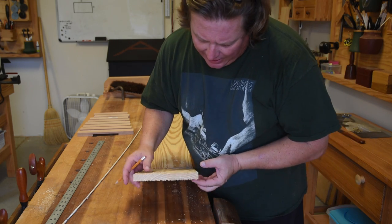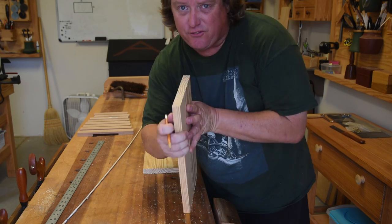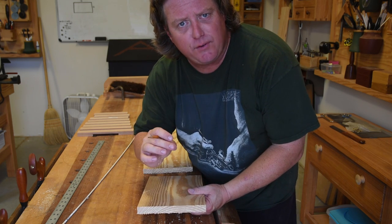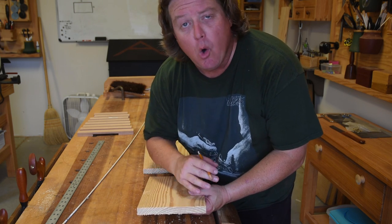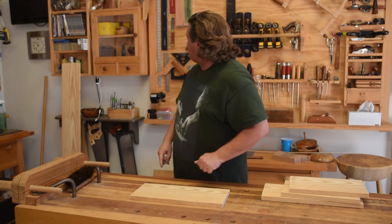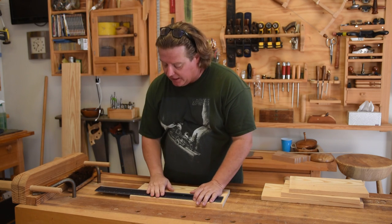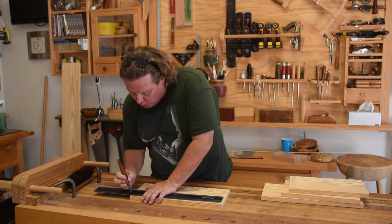But I also want you to notice how rough those panel saw cuts are. This is just butchered. It is fairly plumb and all that kind of stuff, but it is not a clean cut. So that's why I go an inch over when I'm roughing stuff out, so I can refine it at the workbench with either a different saw or a hand plane. Now, in refining our cuts, this gives us ample opportunity to practice what we did in the second section in working our sawing technique. And because we're sawing across a longer board, it really gives us a good workout on skill development.